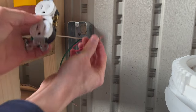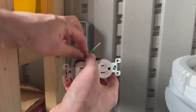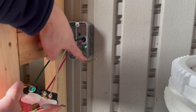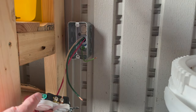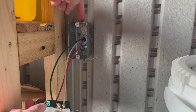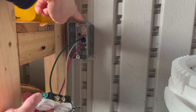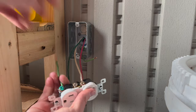Using red as hot. I've got this pigtail attached to the metal outlet box so it's grounded, and then I've got my ground coming in from outside in the electrical box, and my hot and neutral also coming from outside. In the top of this box I need electrical going to the light fixture, so we're going to bring another Romex wire through the top and that will have a ground as well. So we need to tie all these grounds together — I'm going to put one more pigtail here.